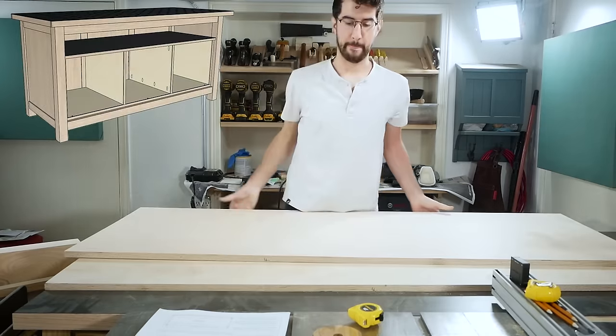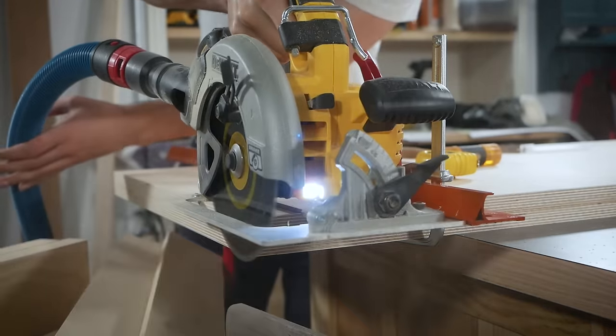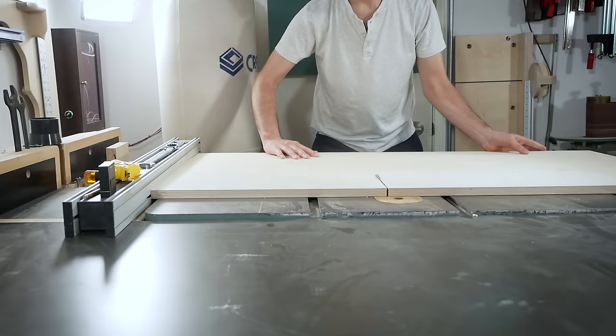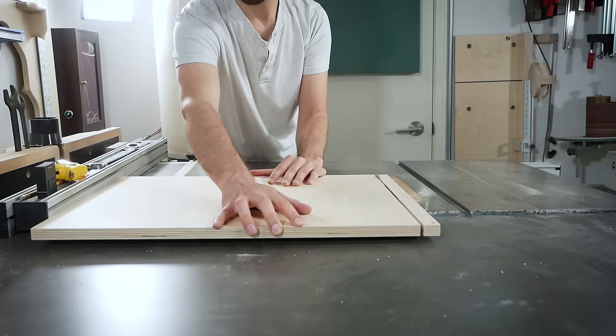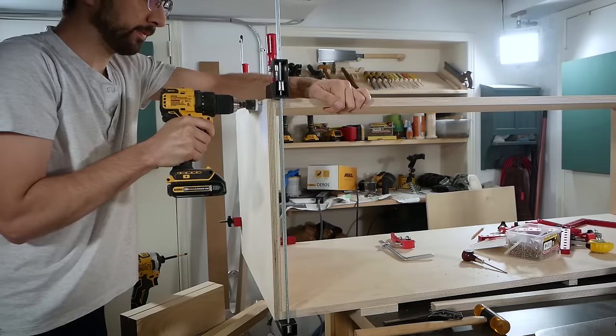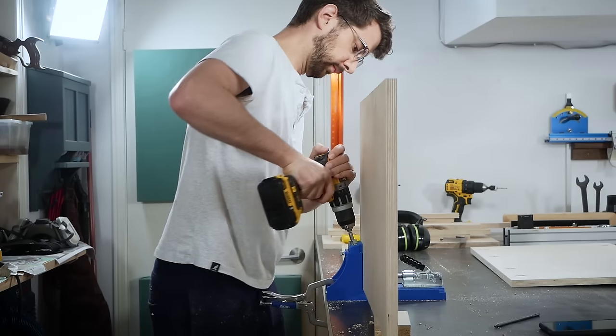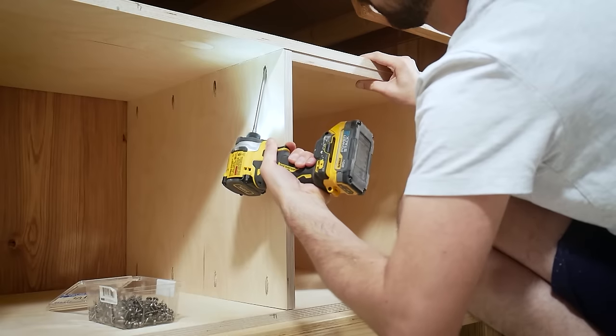Speaking of the bottom cabinet, I designed it dead simple to make because the bench is already super strong, so the cabinet just has to be somewhere to screw the drawer slides to. The sides of the cabinet receive a couple of rabbets each so I could screw it all together with the top and bottom. The two middle dividers were pocket screwed from the inside.